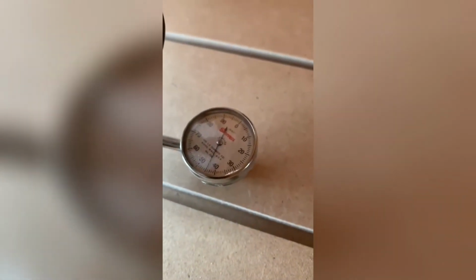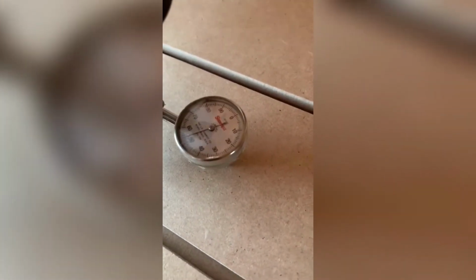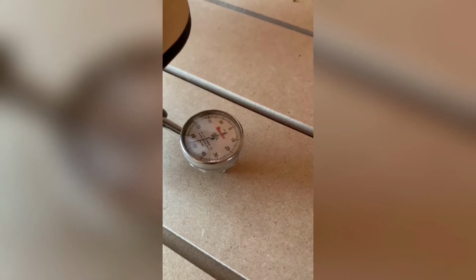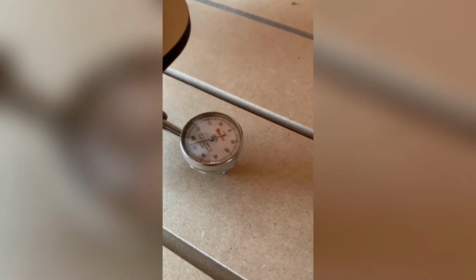So, you know, if you're carving stuff, you really want to make sure that your spoil board's level. So what I'm going to do is create a file. Since this is an E4, it's got a cut area of 24 inches by 24 inches. So I'm going to create a file, an Easel file, that's 24 by 24, and I'm going to resurface it. I'm going to jump over to the computer, show you how I'm going to create a file to finish the spoil board, and then I'll show you the CNC in action.